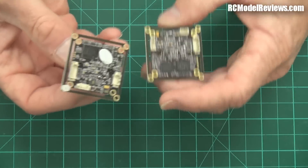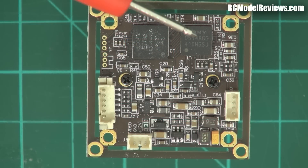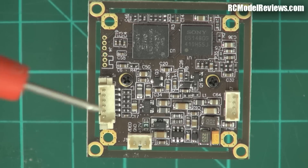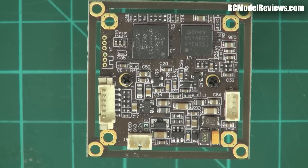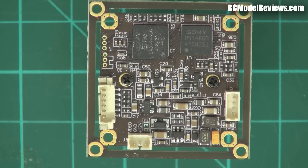Let's take a look at the back of the FeOV camera. You can see there are a couple of large chips — one branded Sony, one branded FeOV. Your normal 600 TV line board camera doesn't have much chippery; it has one single little chip that does most of the work without a great deal of processing. These FeOV cameras, however, contain a 32-bit ARM processor — the same type you have in your phone or tablet — plus dedicated DSP circuitry: digital signal processing circuits designed specifically to process information like sound or video in digital format.